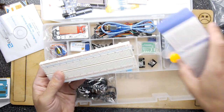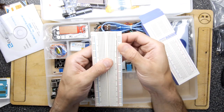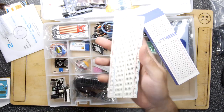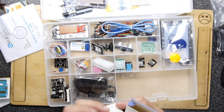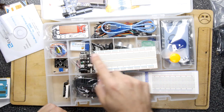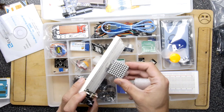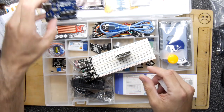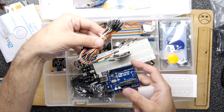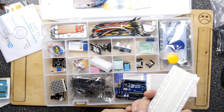Then there's the bigger breadboard — it feels good quality, and it's actually got removable power rails that unclip via little nubbins. It's heavy, which is a good sign. To demonstrate solderless breadboard: you push in the power supply module so the power rails are energised, then plug in your display module, connect your Arduino Uno, and use jumper wires to interface between pins. Then you've got your circuit running — not too complicated.